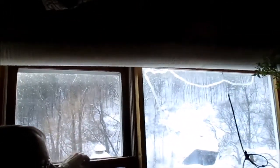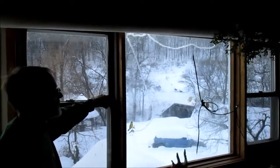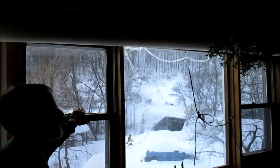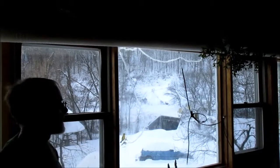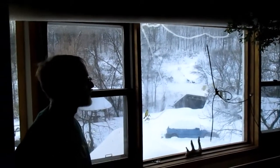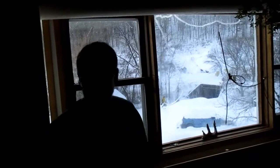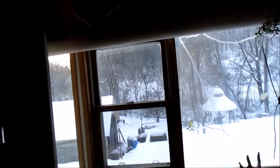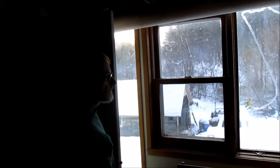The other thing we would do differently on this window is: when the curtain is down on a cloudy day it'd be nice to leave it down, but then the house is too dark. Our plan is to cut a hole in the insulated curtain and put at least a two-foot square piece of marine-grade vinyl in there so a little light can come in. Then we'd just leave the curtain shut on a cloudy day. The curtains save more energy than what we gain with the solar.